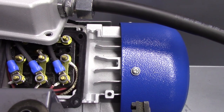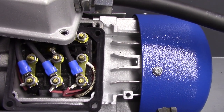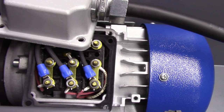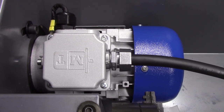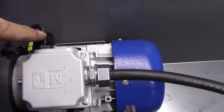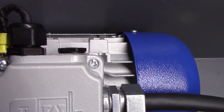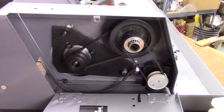You can see the 3 wires terminated onto the motor terminals. For a 3-phase motor it makes no difference which wire goes where — if the spindle turns the wrong way, just flip any two wires at the VFD. The motor cover went on very easily with plenty of depth inside. The ground wire, shield, and braid are all terminated under a yellow ring terminal that is bonded to the motor case. Here's a shot of the motor and encoder all wired up and the motor mounted.